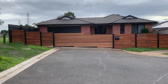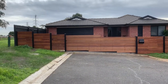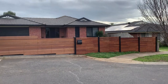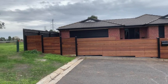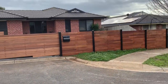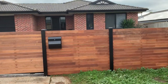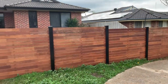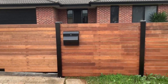I'm going to take you through my latest project. What I've got here is a horizontal merbau fence. As you can see, we're on quite a sloped block of land, so I've done some steps. There's even a step in the sliding gate to make it all match up. It's a bit fancy. It's 90 by 19 millimeter merbau, with about a 6mm gap between each slat, between the exposed posts which are 100 by 100 galvanized steel powder coated in black.